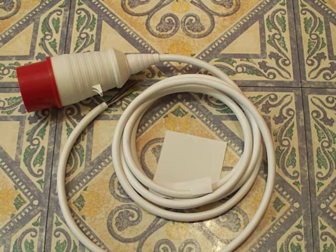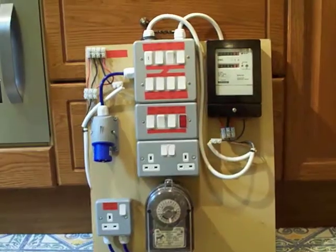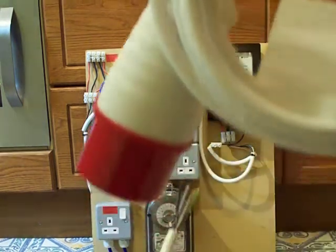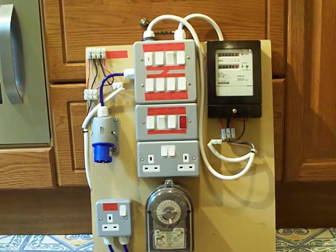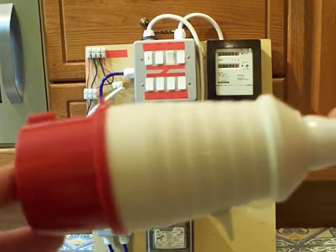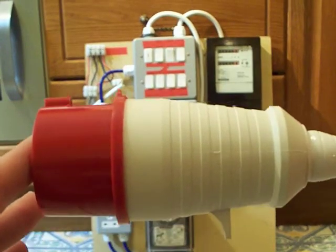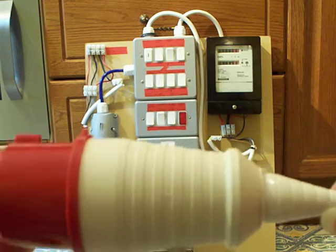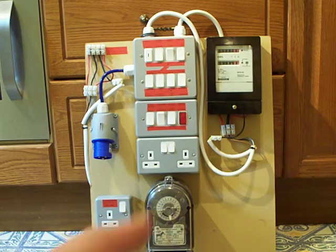So we're going to need to make up a converter so that I can put a coupler onto that plug, wired into a length of standard three core flex with a 13 amp plug on the end. That red plug can have two modes: when connected into the phantom loading unit it will be a phantom load plug — it can supply isolated 240 volts, only around 20 watts or 20 VA, but that 20 VA is enough to make that time switch run.